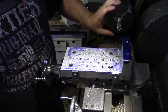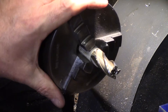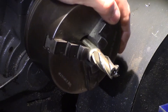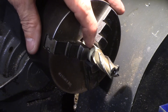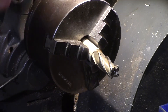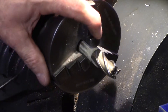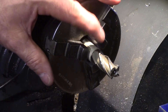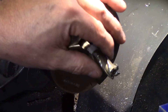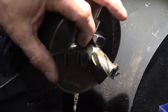Obviously you put a milling cutter in your lathe — if you're milling you're better off putting it in a collet chuck — but for just this sort of rough milling I don't really bother, I just stick it in the three-jaw chuck. One good tip: get some normal writing paper and do one wrap around the cutter. That'll actually help to secure it, there's less likelihood of the tool steel slipping on the jaws. It just adds a little bit more security and stops any accidental movement of the cutter coming in or out.